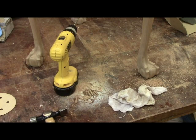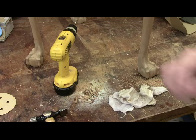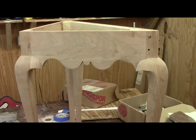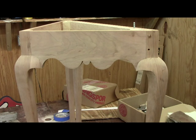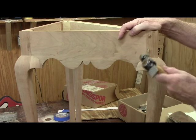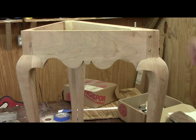After making the dowel rods, I cut them up into one inch pieces. I'm going to drill some holes — drilling with a quarter inch brad point bit. After I get them drilled, I'll put a little glue on the end and then drive them home. I've got 14 of them to do around the table, and then I'll saw them off and pare them flush.